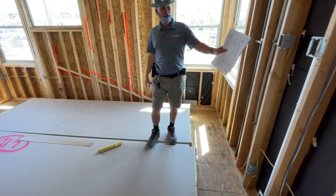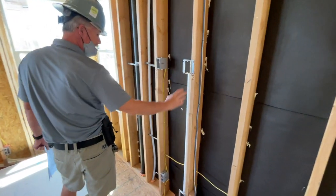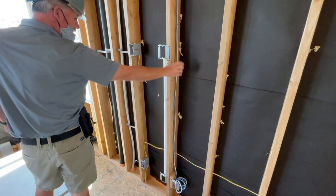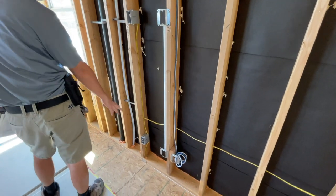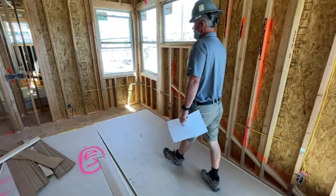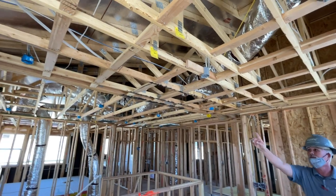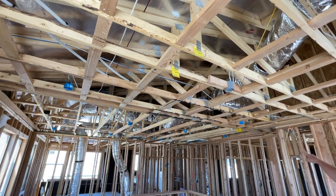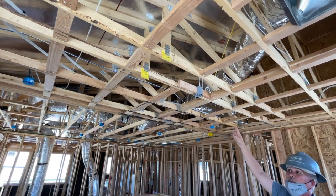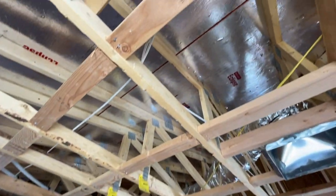You have another plasma pre-plumb on the outside wall, so you can bolt your TV, plug it in, put your HDMI cable down, RG6 and Cat6 for your TV here, and everything can plug in on the bottom. Standard plugs around the rest of the room. Four lights in the ceiling were added also. Blue box, blue box, blue box, blue box, and the standard ceiling fan pre-wire, all under the radiant barrier again to keep that heat blocking on the house before it ever gets hot.